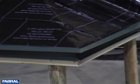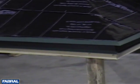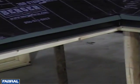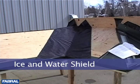Now that all the Eave trim has been fastened, the underlayment can be attached. Cover the entire roof with 30-pound felt paper or titanium underlayment. Ice and water shield should be used at all valleys, chimneys, and skylights. In cold climates, ice and water shield should be used at the eaves and extend 24 inches past the exterior walls.